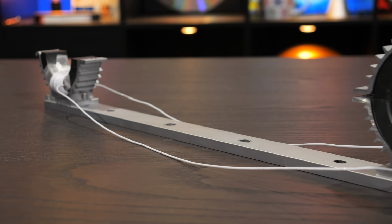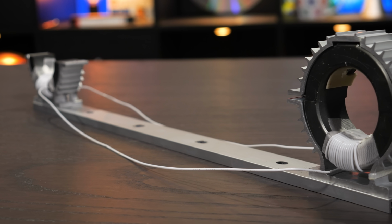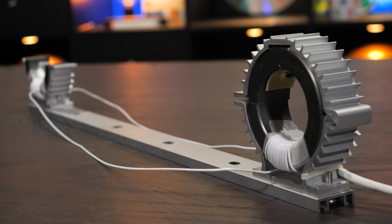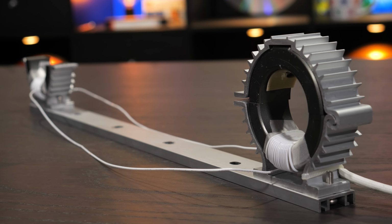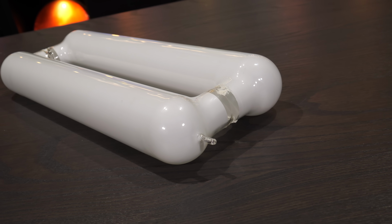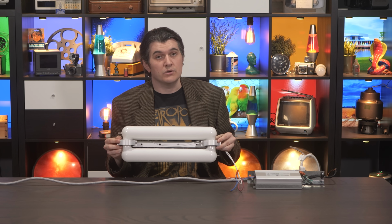This meant ferrite compounds, which are extremely magnetically permeable but not electrically conductive and therefore don't form eddy currents inside, were required for high-frequency power coupling. They weren't invented until the 1930s, and even though they were fairly common by the time Anderson filed his patent, ferrite was still an expensive material. In fact, that's the main reason this lamp gets narrower where the cores attach. Making the tube diameter smaller requires less material in the cores.